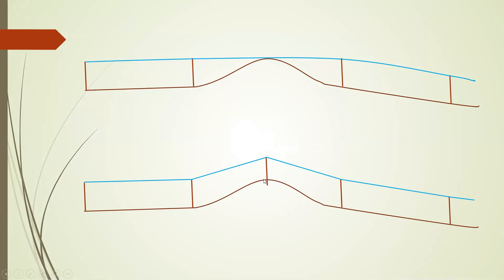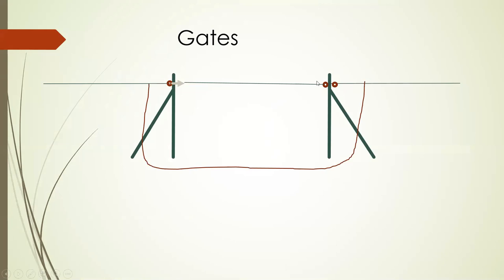In gates, sometimes I have seen people running the same wire and they just take it off, and when you put it on the ground, you are grounding your whole fence and you lose your energy. What I do is I have my fence insulated here and my other fence insulated here, and I have my gate insulated as well, getting the energy from this side. When I unhook it from here, the gate is no longer charged, and if I drop it to the ground, it doesn't ground the whole fence.